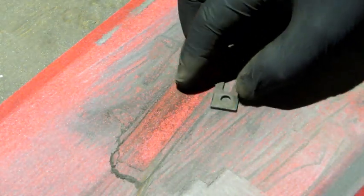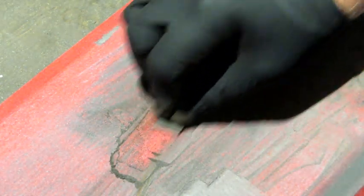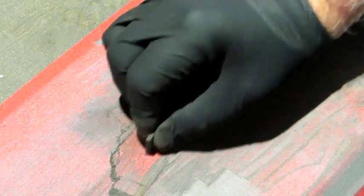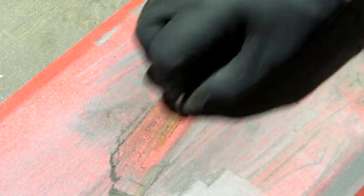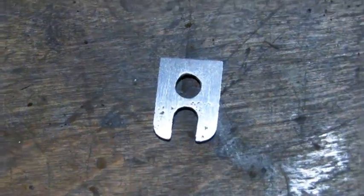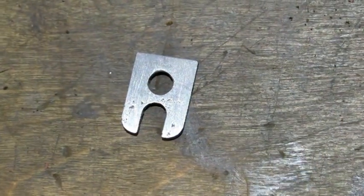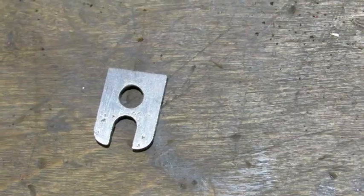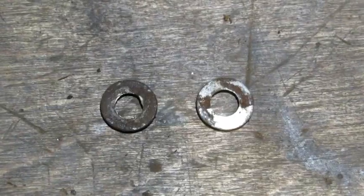Normally these don't have machining marks so you can't really overdo it. While you're at it, you might as well go ahead and work the narrow sides at the same time — flip it all around and get those. This frog adjustment plate had deep pitting on both sides so I stopped right here. There's no sense removing any more metal — it's not going to make your plane function any better.